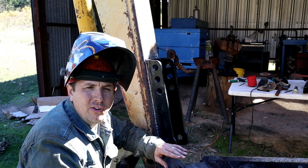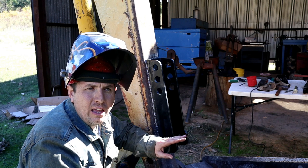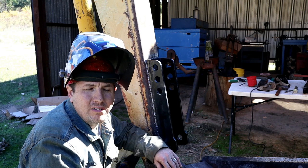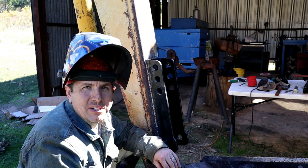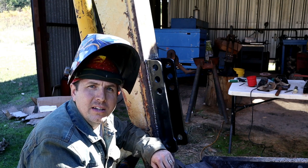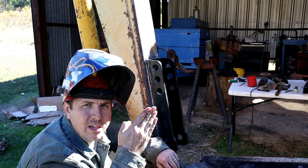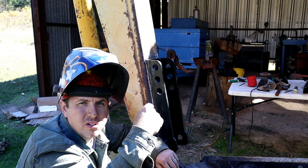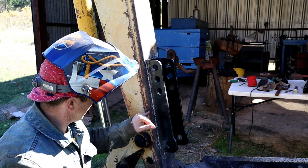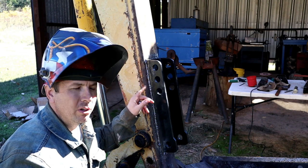It says it's between 115 and 240, and I was set at 40 on the fine dial. I don't know. Anyways, I'm guessing it's around 160. But welding with the 7018, what I found worked better was to come and kind of look underneath where the rod was. And you can see here progressively I got a little bit better until it's almost looking like something that might happen with a MIG welder.